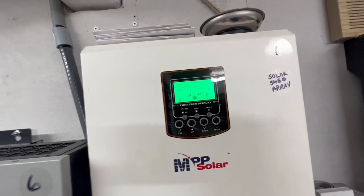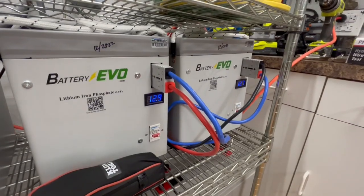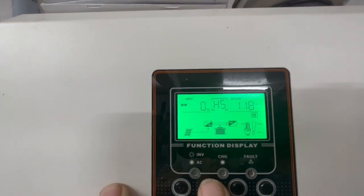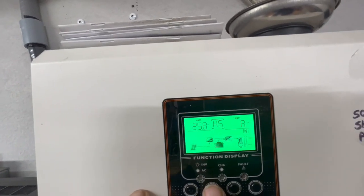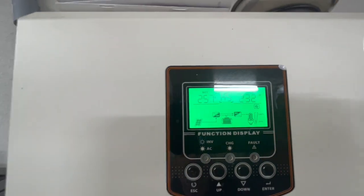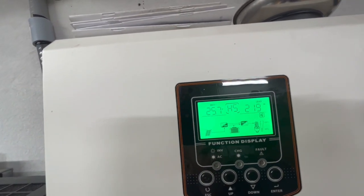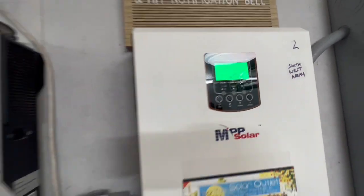It's going between about 15 and 20 amps to run that second mini split. Like I said, we can go down to 10.5 volts on these, so we have quite a ways to go. We have no amps coming in off our solar right now — the sun's not hitting the panels. So we're draining almost 20 amps out of our batteries, about 10 amps on each unit, around 230 watts each — so about 460 watts total that we're draining.